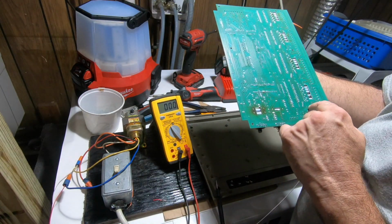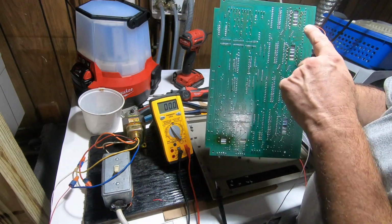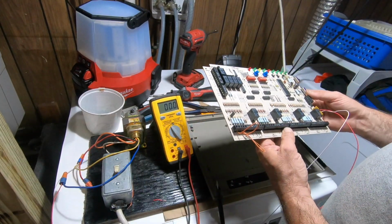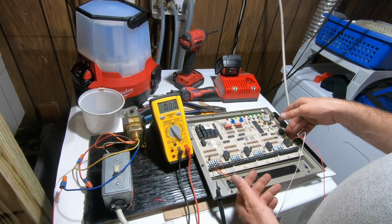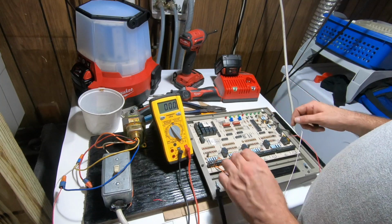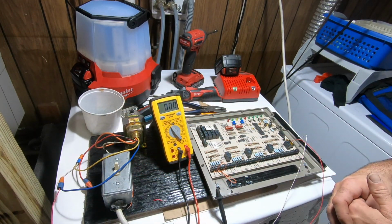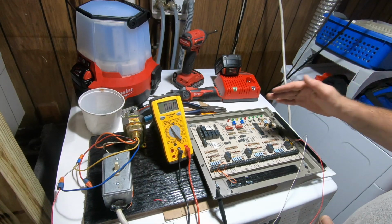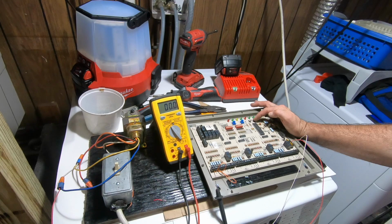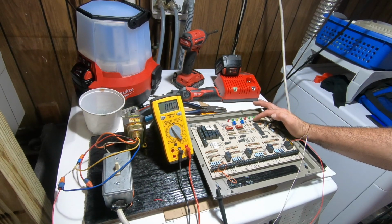This one looks a little wacky, but this around thermostat one doesn't look too bad. These are switches. Thermostat one's here. That's all darkened. I'm wondering if I moved it to thermostat two, make thermostat two call, if I can get it to do anything. So let's just see now if we can get this to turn on. It's gonna take 3 minutes for the purge. This is saying purge override, bypass purge. Doesn't want it.